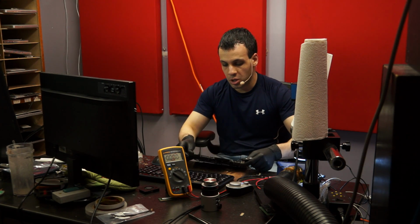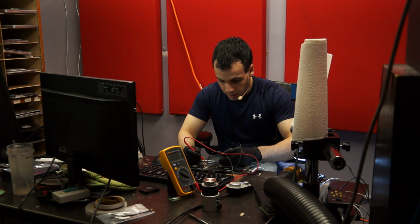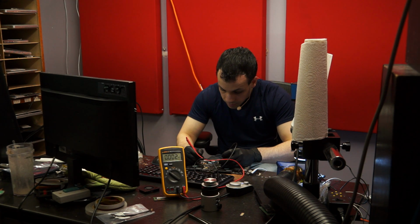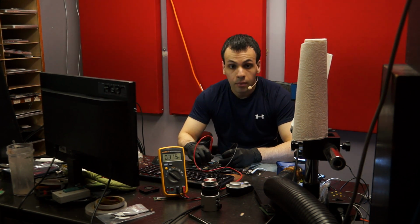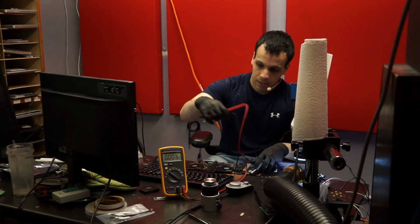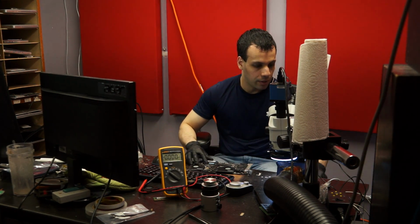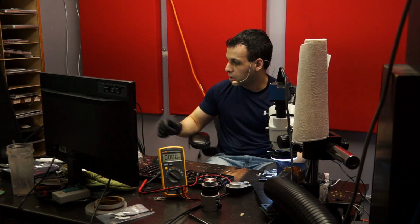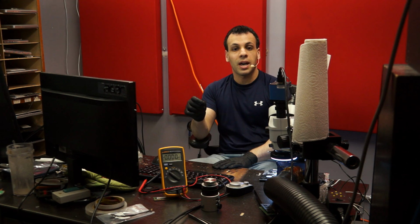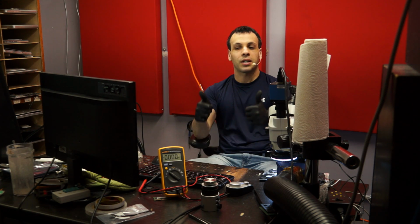So if I'm to measure on C7771, what do I get but that's not 1.05, not replacing the MCP. The reason I bring this up is because a lot of people at this point will try to replace the MCP. Even worse, they'll start burning the MCP. And you know what's bad about this? What's bad about it is that when they do that, it'll work again. So they'll say that they fixed it.